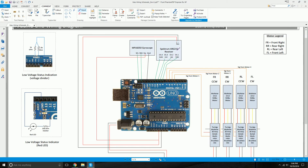The only things left to connect are your receiver channel inputs. Channel 1 is throttle, channel 2 is aileron, channel 3 is elevator, and channel 4 is rudder. Connect channel 1 to digital pin 8, channel 2 to digital pin 9, channel 3 to digital pin 10, and channel 4 to digital pin 11 on your Arduino. Make these jumper connections and you're pretty much set — that is the main wiring connection you need for your quadcopter.